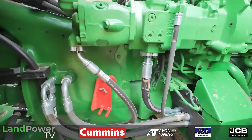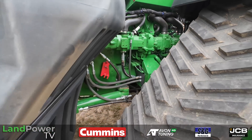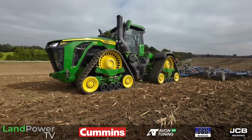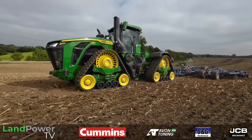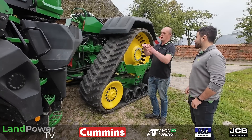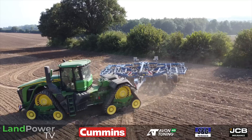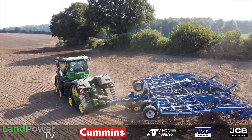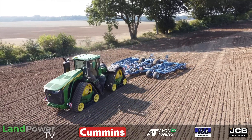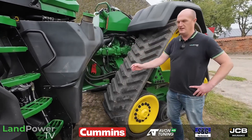The key reason for the structural chassis is traction. There's a minimum amount of weight you really need to get the power down to the ground. With a frame you're quite limited in ballasting options, whereas with the structural chassis, the whole tractor is ballast. To get the power down for medium tillage, you need about 45 kilos per horsepower rated. It also gives more flexibility — you can take out bits to make it narrower at certain points or adjust weight distribution, giving you more flexibility in the actual characteristics of the machine.